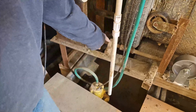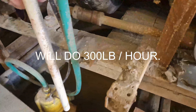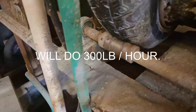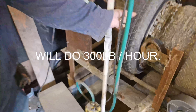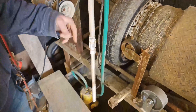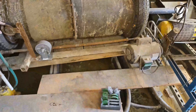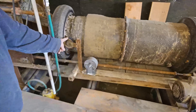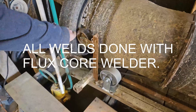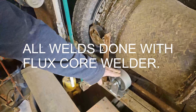On top of a pillow block, on the outside of the rod, I put in some collars for the wheel to ride on. The wheel is welded to the tank and a hole cut in the middle. The entire apparatus is raised up 10 inches on this side, which means the tank wants to go downhill, so we put in a wheel right here. This wheel is wearing out fast — it's a rubber wheel on rubber. The tire is not wearing out but the rubber is, so I've got my spare ready to go for when that wears out all the way.